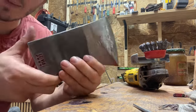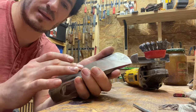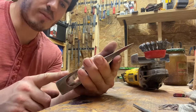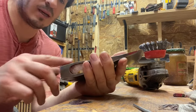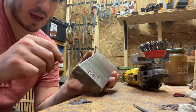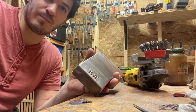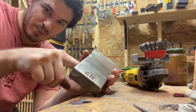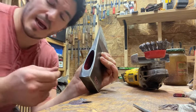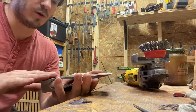It's pretty much just a question of how clean you want it. That paint — it must be a dip paint; I think they probably dip it, because the eye is coated through and through as well. It's a very, very durable, high-quality paint — it's just not the look I'm going for. I do have a walnut blaster. I got my media blaster from Harbor Freight for about $15, and the bag of walnut shells was maybe a little more. I'm going to spray into the eye ridges here to get the paint out, because I want as much grip in the axe eye as possible.